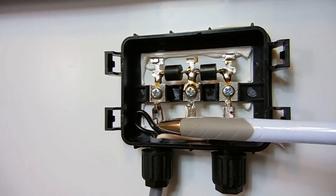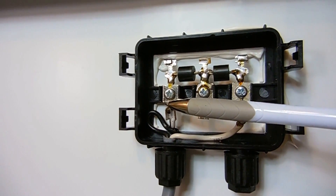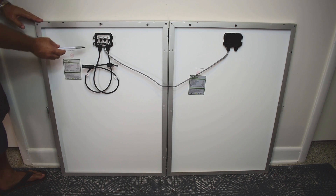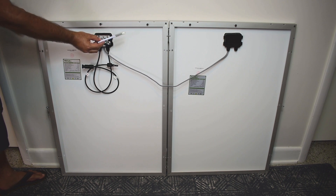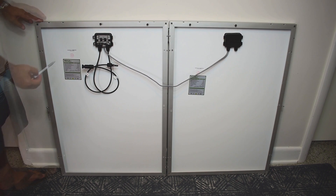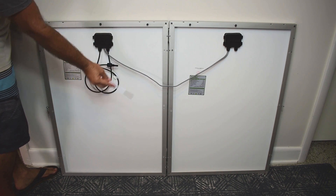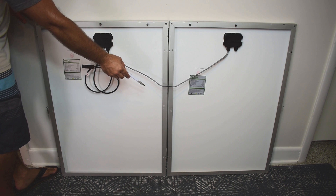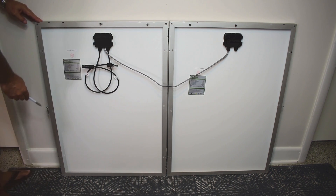Inside the box you can see the positive going out to the white wire and the black wire going to the negative side. The hinge was bolted to the frame, and inside the diode box cover where the MC4 connectors are located, you can see the blocking diode and two bypass diodes — the series connection between the two panels is made inside this box. The bottom is sealed with marine 5200 sealant. Six inches from each end of the panel, top and bottom, there are mounting holes on both sides, and in the center there are holes for ground screws.